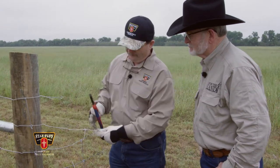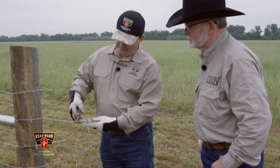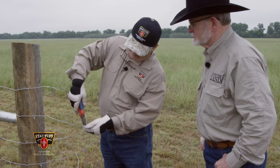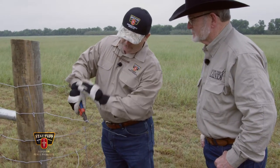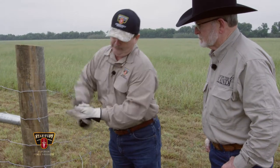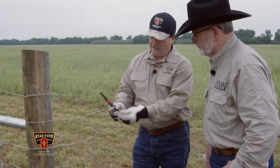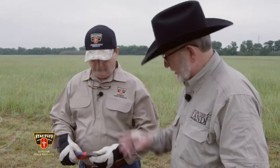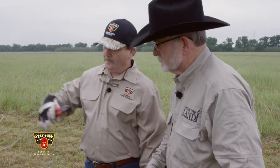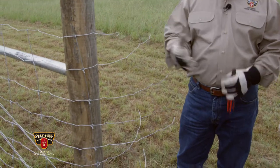These little knots hold on very tightly, so it's a little more complicated. My favorite method is to get a pair of lineman's pliers that'll fit in between those two little loops, then place the heel of your hand just underneath that wrap and bend them back towards each other fairly quickly — it loosens right up. You slide that knot right off, and now you've got nice smooth wire to wrap around your post with no obstructions and no sharp edges to slice you or your glove.